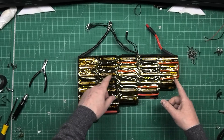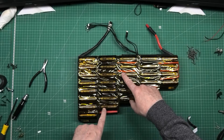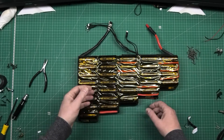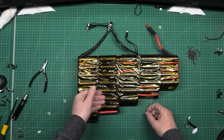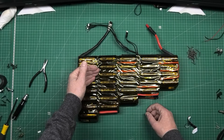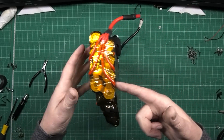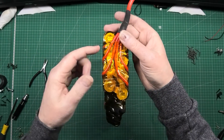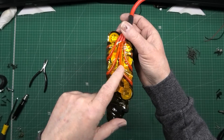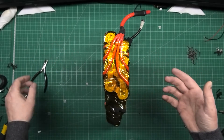Cell number six is part of that one and part of that one — that ain't going to be very easy to diagnose. When I say cell number six is always low, the discharge rate was fine; it was only when I left it to settle it used to be around about five or six millivolts low. Also, people have asked about the series wire — you can see I've split the load between all six parallel cells to even it out. If you just connect to one positive you get a massive surge of current, so it's always best to split the load.